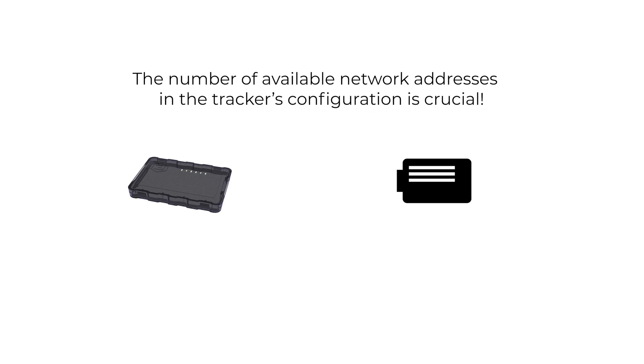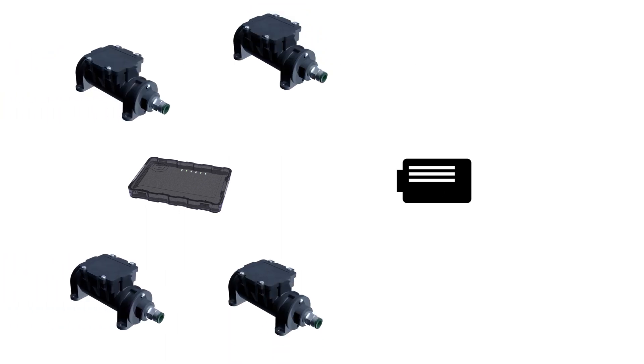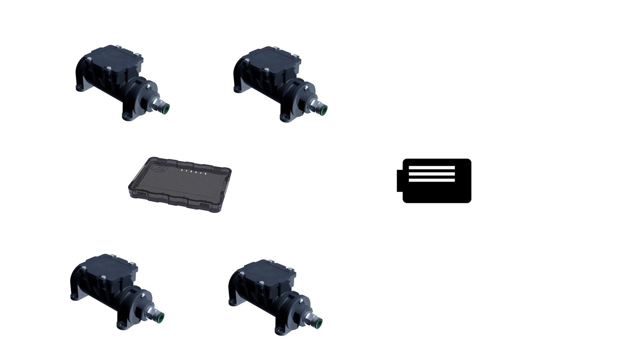The central unit can be connected to a GPS tracker or gateway by means of the RS-485 interface. The LLS protocol is used for communication between the devices. In this case, we installed the central unit along with a GPS tracker by GLONASS Soft company and made sure the tracker supported as many network addresses as needed, because we had four axle-load sensors paired with the central unit, each occupying two network addresses. We also had two wired fuel-level sensors, Escort TD, connected to the GPS tracker.